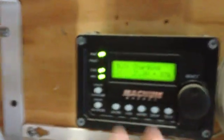Since I built my system, Outback has come up with a new design where you can use a battery bank like this and also grid-tie. The only time you use the batteries is if you have an outage. The way I do it, I have to simulate an outage by turning that breaker off. Right now we're at 25.5V charging up to 27.7V — it will stabilize around 27.5V.